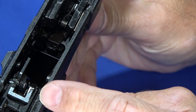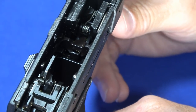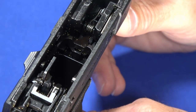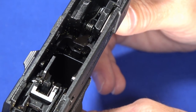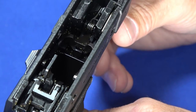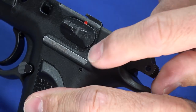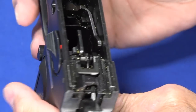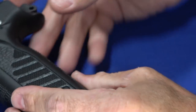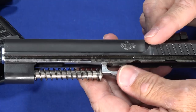The fire control group in a double action, single action is a little more complicated. Those little dots you see are pieces of brass — I believe it's a tolerance issue also related to the failure to extract issues we were having before I polished it. This thing does a number on the casing, and you'll find them right in there. I think there is some opportunity for tuning in the overall design and specifications that they'll probably work through.